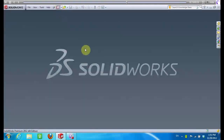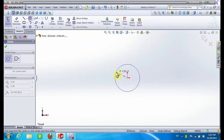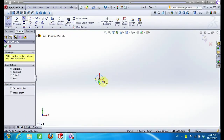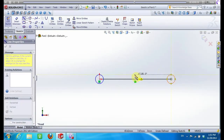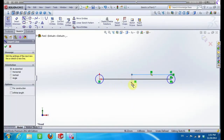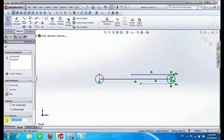Now exit from this model, go to new, part, sketch, front plane, create circle, put 7.5 millimeters, create this line, put 132.5 millimeters, create this circle, put 7.5 millimeters, create this line, put 72.5 millimeters, create this line, put 57.5 millimeters,